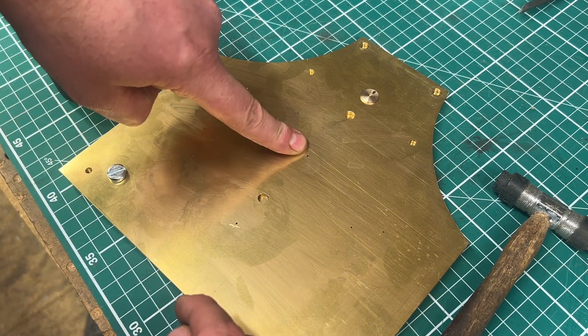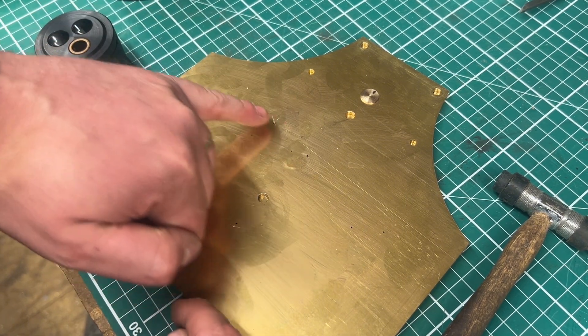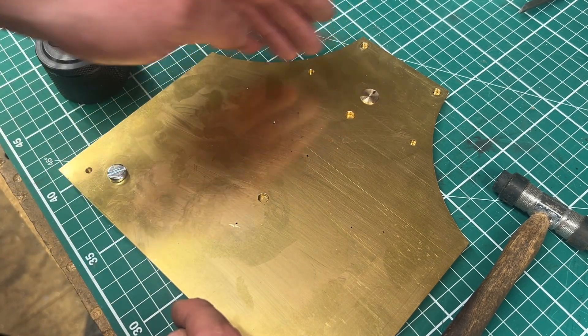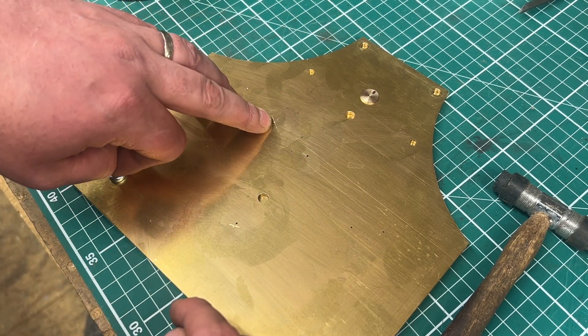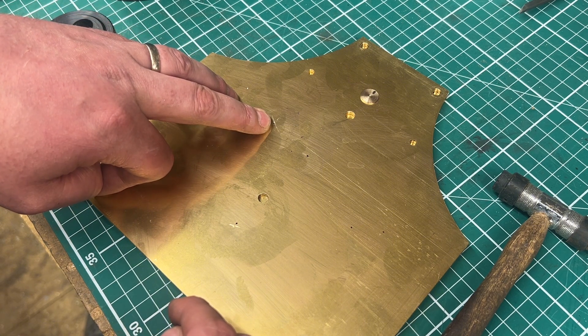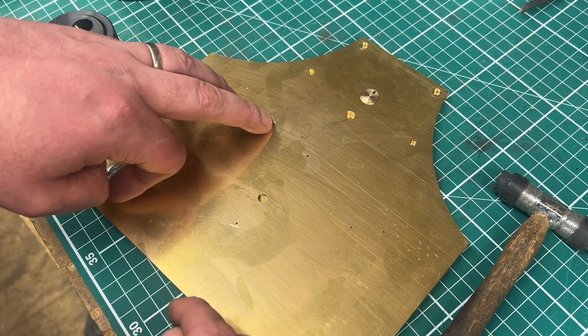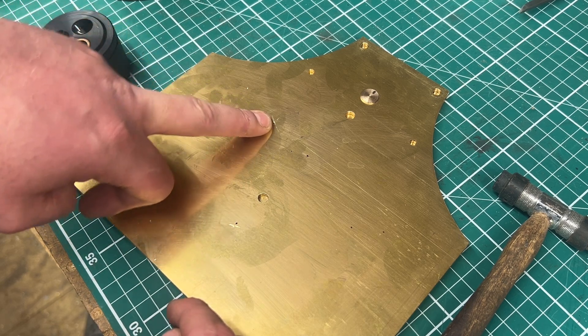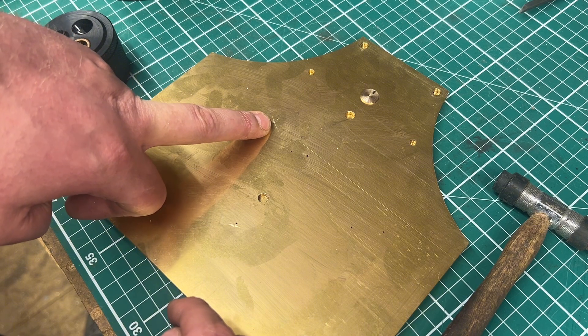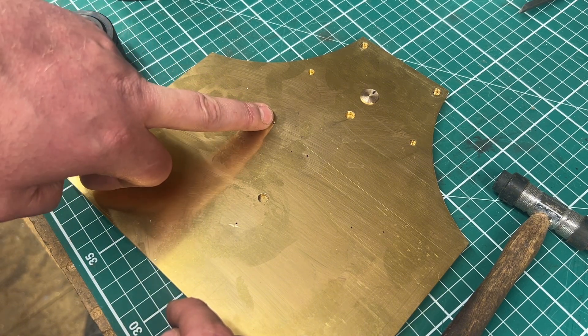I went from the half hour wheel to the minute wheel and intentionally hit it so that I do hit this little spot. These holes here are the theoretical holes, and unfortunately because I've made my wheel by hand, I must have been a fraction out on one of the wheels. It's only a fraction of a millimeter, but I'm going to go for it — I'm not going to take the spot on the theoretical position, but I'm going to take it to the proper depth.